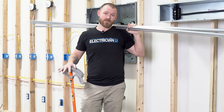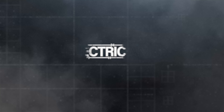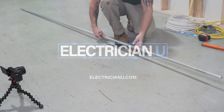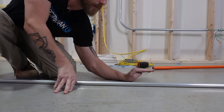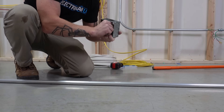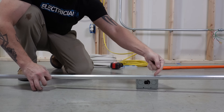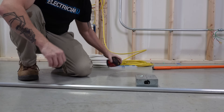How do we bend an offset in conduit? When we're going to do an offset, we want the bend to kick up like this. Say that we have an obstacle like a box that we want to clear — we have to bend a portion down this way and then bend another portion this way so it'll clear over that box.